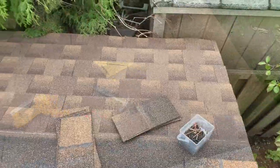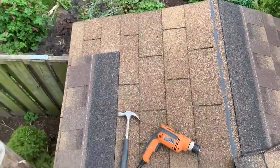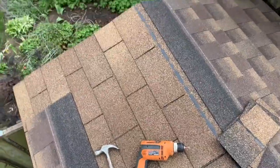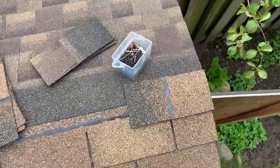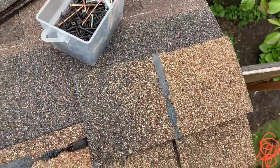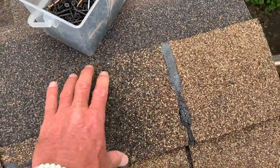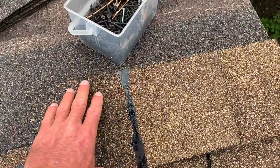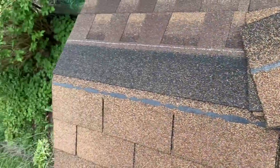The roof is done now. Yeah, I know the two sides don't match, but I had an extra bag of shingles left over and you can't buy these ones anymore, so c'est la vie. To finish off the cap, we've got these end pieces that we cut. You want to nail them down behind the line and then just overlap them going this way, nail them down behind the line, and you'll have a cap line running right across the peak of the roof.